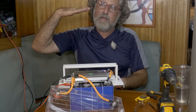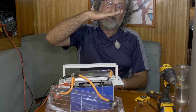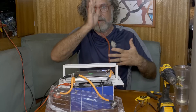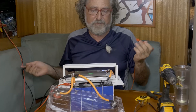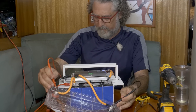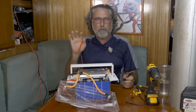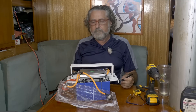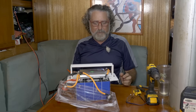Lithium batteries don't go up much in voltage until they're fully charged, and once fully charged they go up very fast because they have no place to put the power. It's actually bad for them inside when you get up into that hockey stick region — instead of getting 15 years out of a bank, you might get six or three. So we don't want that. Now it's 14.44 volts. Usually if the batteries are all balanced nicely you'd expect it to click out at around 14.6 volts, but I've noticed this BMS manufacturer sets their numbers a little higher. I've been charging to that higher amount with their BMSs and nothing's burst into flames or leaked gas.